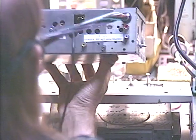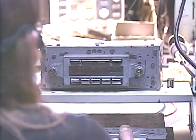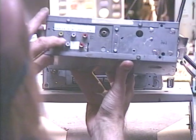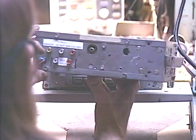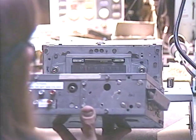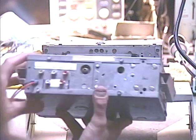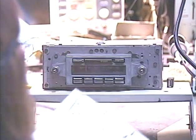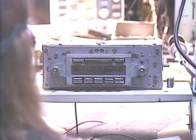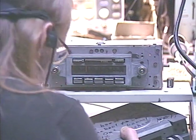It is extremely important that you do not mix these up — yellow has to plug into yellow on the 8-track player, otherwise you're going to send 12 volts into the conversion's preamp and blow the conversion board, which would not be covered by warranty. That's what we've got on the radio. The 8-track has three matching jacks that connect to the radio, all labeled, and then there's the aux input — in the converter system it's more practical to put the aux input on the 8-track rather than the radio.